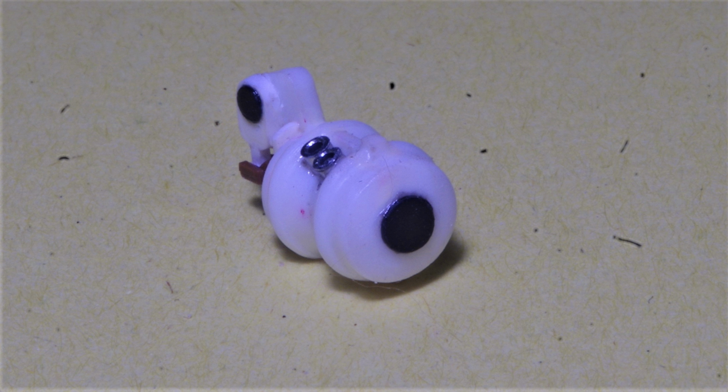And the last detail item to add is a pair of 1/16 aluminum tubes, which are the fittings that the air hoses will thread into. 1/16 tube is slightly oversized for this part, but it's a convenient size to work with, and the extra size won't be noticeable once the brake chamber is painted.